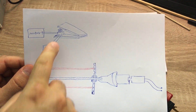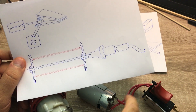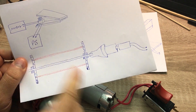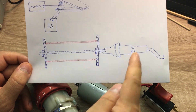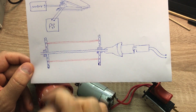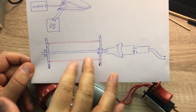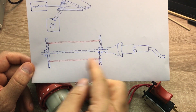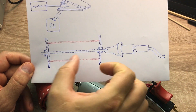This is another schematic. For the foot pedal I'm going to use two wooden blocks and remove this switch, put it here, and basically two long wires will be connected to it — one goes to the power supply and one comes back to the motor. The motor and gearbox are shown from the side, and those wooden blocks clamp the coil former. We can use a coil former with different diameter or different length, and we don't even need a cylindrical coil former — we can use any shape including rectangular, because the clamp will hold it and keep it centered.